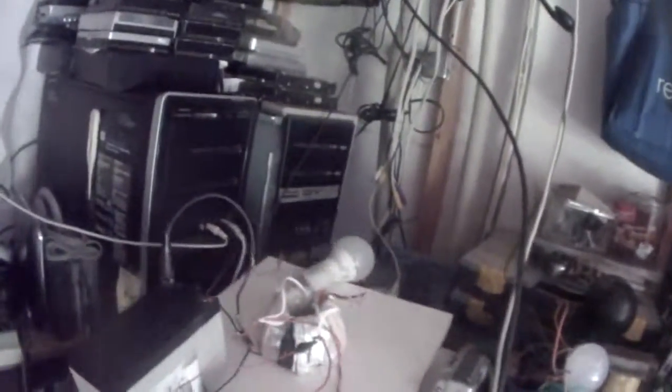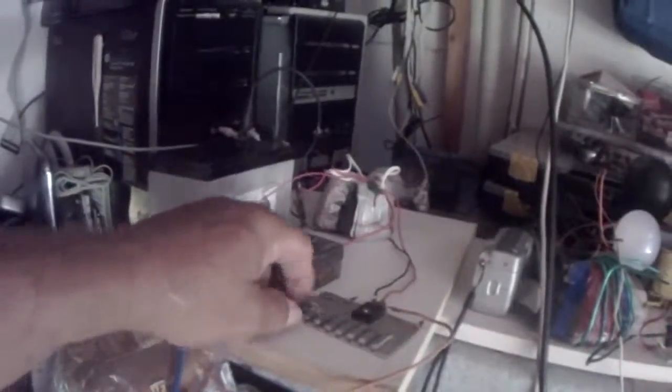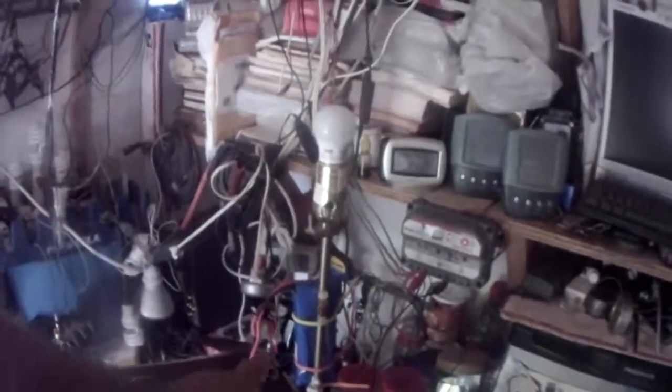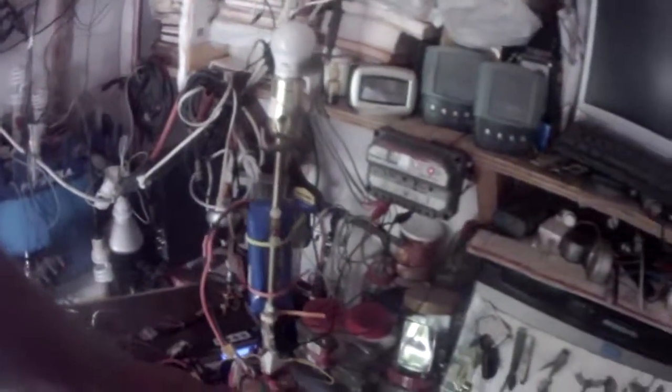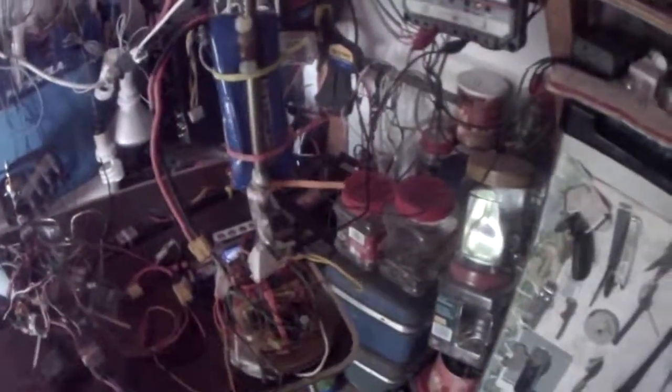This guy runs — it's been running all night. With an LED lamp on my toroid round — it's got six winds on it, six separate ones — and it's pulsed with a FET transistor at a rate that I set with my 555 pulse width modulator. I got three settings on there for three different speeds, three different capacitors for the frequency. This lamp runs for a long, long time. I don't know what I did — I got some iron windings and they're mixed with copper windings, mixed with stranded copper windings. And that guy runs — when I tweak it out, it runs night and day.